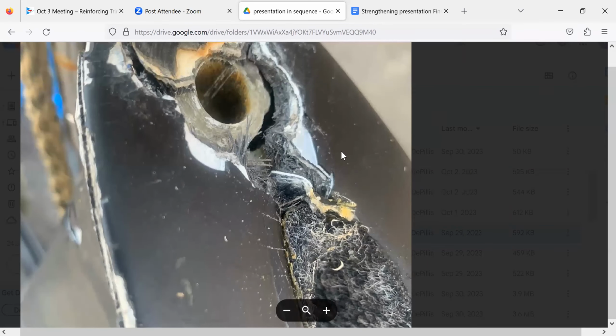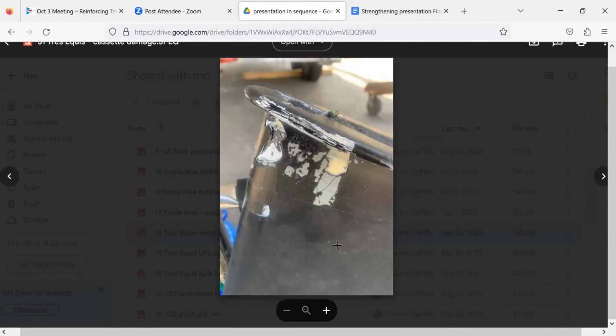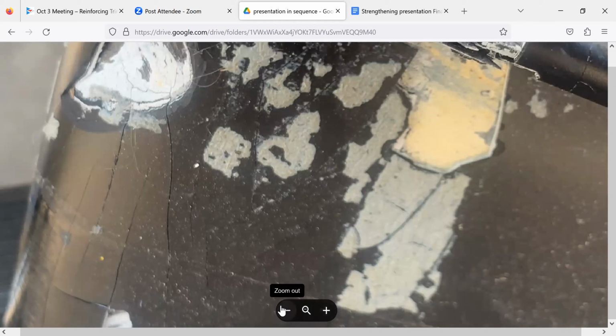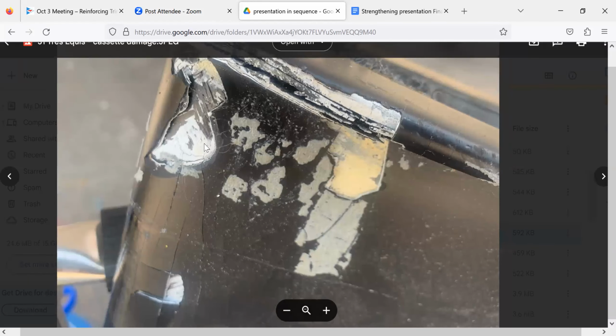The exterior facade, the really nice one, the machine finish, has no representation of what's inside. What had happened is they took a carbon tube, but they didn't wrap it all the way down the base. They actually left about a couple of inches separated between the head and the base where they wrapped it, which ultimately allowed it to flex and start to crack. Now, would it have led to the entire cassette breaking? Probably. But this was just a defect that was discovered really quick.